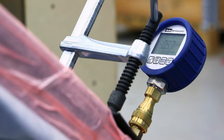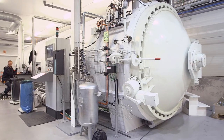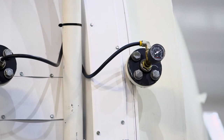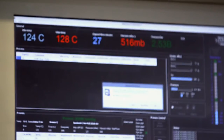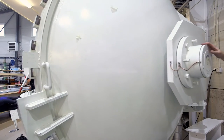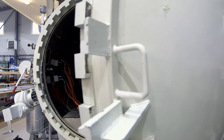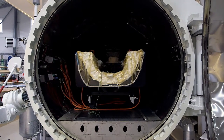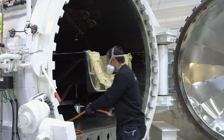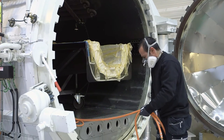This is then pushed into the autoclave, which is our cooking vessel — basically a pressure pot. Under pressure of up to five bars for some of the components, that's equivalent to 51 tons per square meter. The autoclave is used extensively in the aerospace industry but not so much in the marine industry.